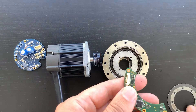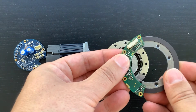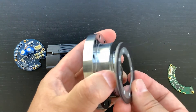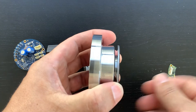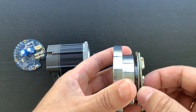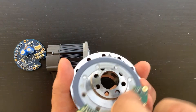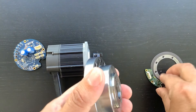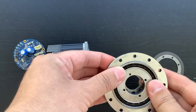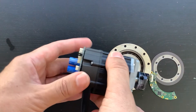The final piece of the puzzle are precision rotary encoders. This sample encoder consists of a magnetic ring and a reading head. Such an encoder should be mechanically linked to the output side of the harmonic speed reducer. The reading head is connected to the Servosila brushless motor controller using a cable that may pass through the hollow shaft of the harmonic speed reducer. The encoder provides the servo controller with information about the angular position of the output shaft.